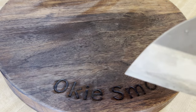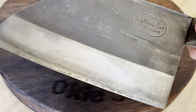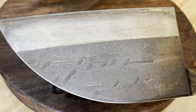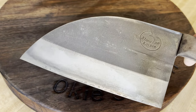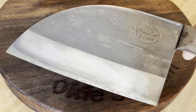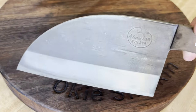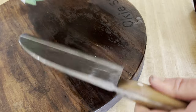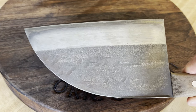Here it is. After several layers, you can definitely see the color has changed — it's gotten a little darker and has that protective coating on it. I ended up doing this several times for about five to eight minutes between each one, I think about four times total. Then I washed it off with water, dried it, and redid it. If you start getting some splotchy areas, just continue to massage it in. Now we've got a patina coat on this knife, so it should help protect it.